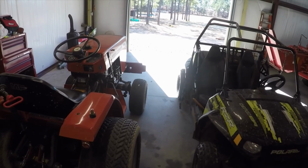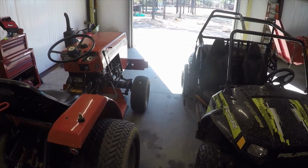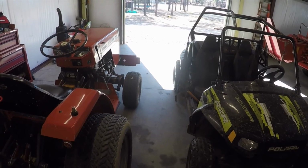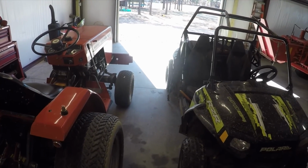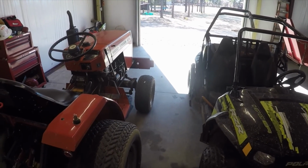Traffic pushes the clean rock around a little bit. So every now and again, I get the tractor and landscape rake and brush over it. I'll work the gravel from the edges back all the way across it, back and forth a time or so. The landscape rake will also help pull up the gravel that's been packed down in the other gravel. So a couple quick passes keeps the driveway looking good and maintained. It's part of having a gravel driveway, and a good reason to have a tractor.